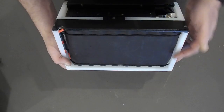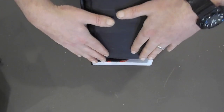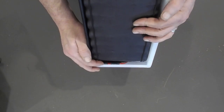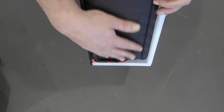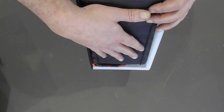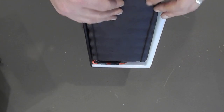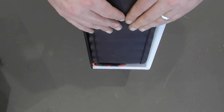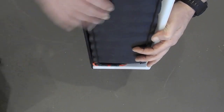We've got some neat stuff coming along those lines. The battery connection is just Andersons — a bungee just holds the battery from moving around, and the Andersons connect it to the rest of the system. If you needed to swap that out it wouldn't even take tools. Interestingly, this is 280 watt hours of 12-volt LiFePO4, so if for some reason you needed a strong battery right away, you could slide the bungees aside, unplug the Andersons, and you've got a lot of power in your hand.